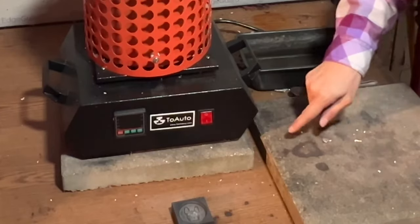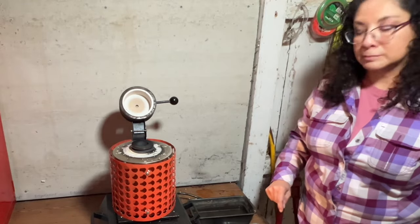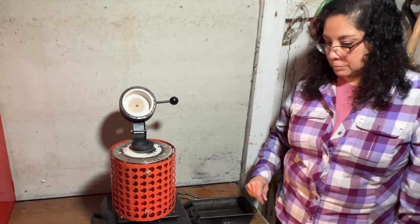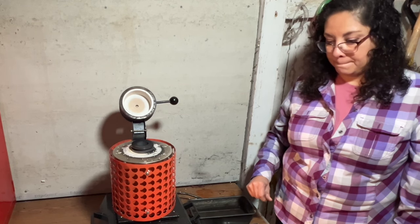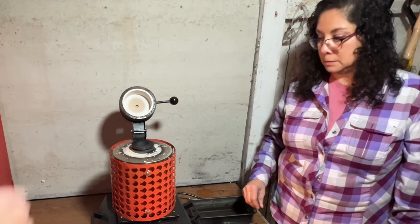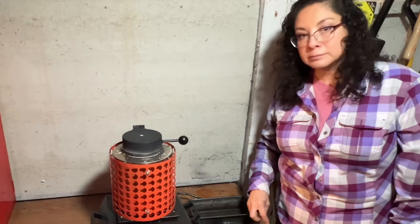We've got the furnace. Just turn around. This right here? Yep. Okay. I've got it pre-loaded with the temperature that we need. Okay. And I learned a trick from AJ Bain from AB Customs. He's a famous silver pour artist. He said, let the temperature go above and past the temperature that you're looking for. Yes. And I'll close that up also, by the way. Okay. And then once it goes back down and settles down at the temperature, then you're ready.